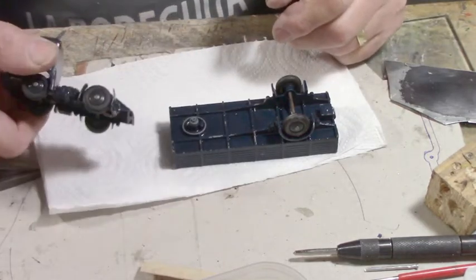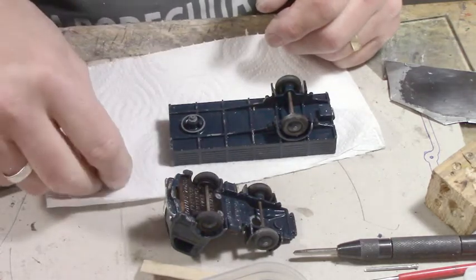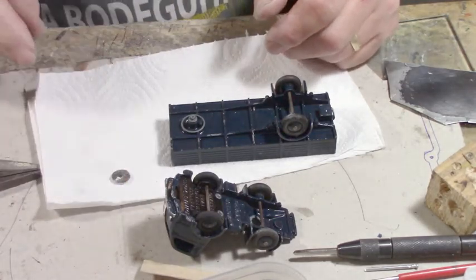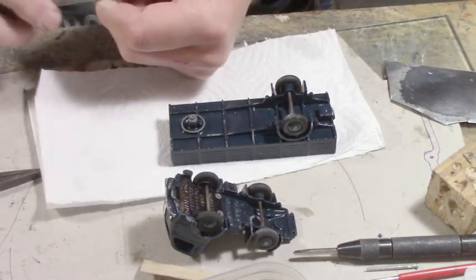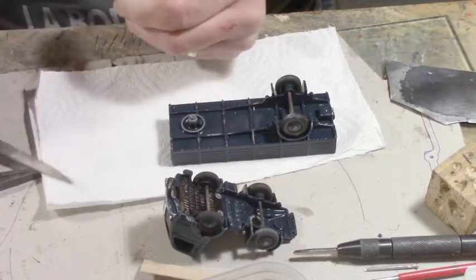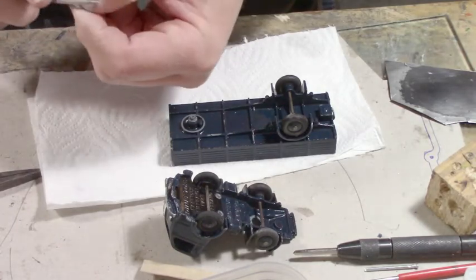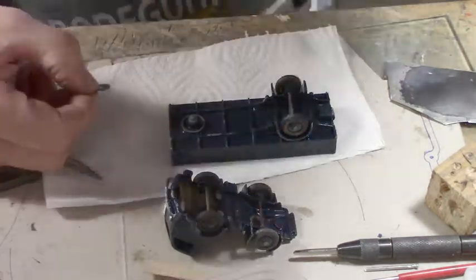It's a good size. Now you take the washer and you make an outline on a piece of tin and cut it out and make a hole in it, a 3mm hole. And there you go. Now it's a little crooked looking. I'm just going to file around the washer to make it look rounder. You can clamp it on if you want. I'm just filing around these edges. Give me a couple of minutes here and we'll have a nice round washer.